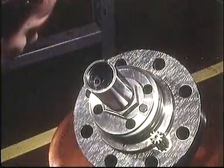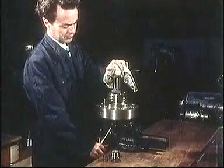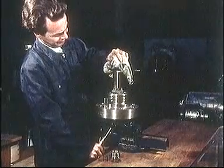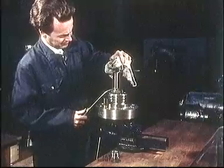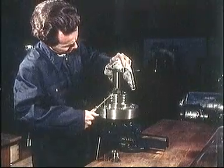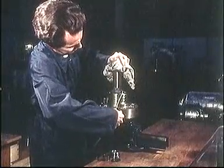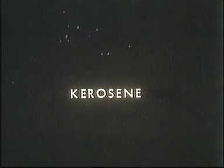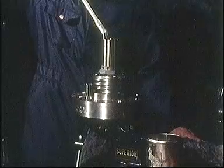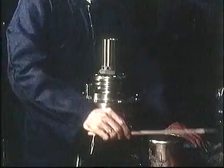When the seat has been wiped dry and checked, the Vaseline is blown out of the valve housing with compressed air. Note that the blowing direction is the same as the oil flow direction through the valve. When the Vaseline has been blown out, the valve housing is washed in kerosene, then blown dry and lubricated inside with molybdenum disulfide.